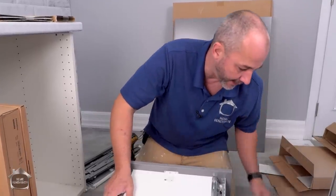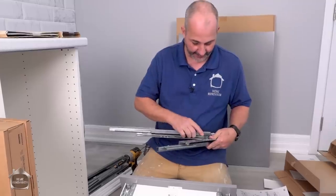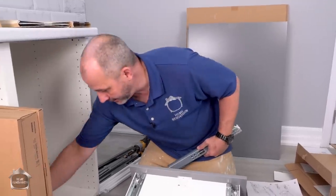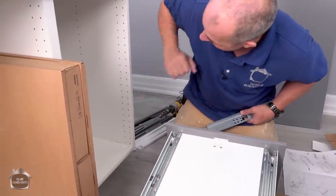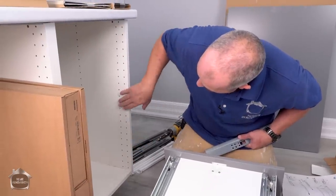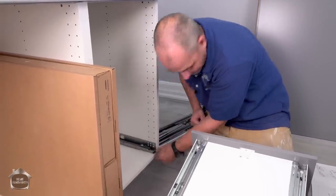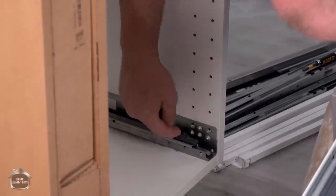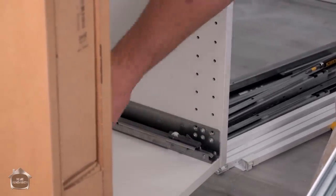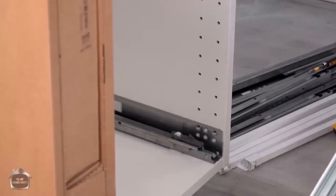Oh, finally, we get to install the cabinet. Okay, so now we have the instructions for where to put the tracks. Now, left and right side, of course. This is the front of the drawer, and they're showing how to install it. I know there's holes all the way in the back, but generally those are for shelves. These drawer glides get screwed into here and the mid part, okay? Generally speaking, the first hole goes in the first line, the third hole goes in the third line, and they all correspond. The first drawer sits right on the bottom, so this one's actually kind of easy to install.